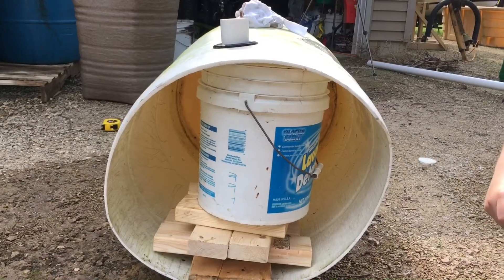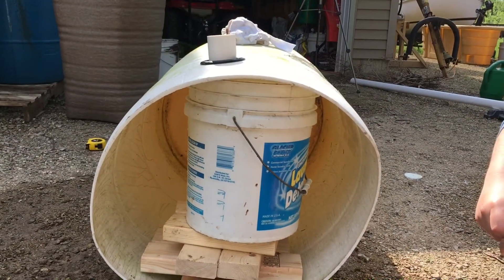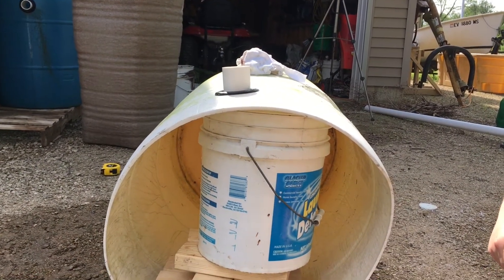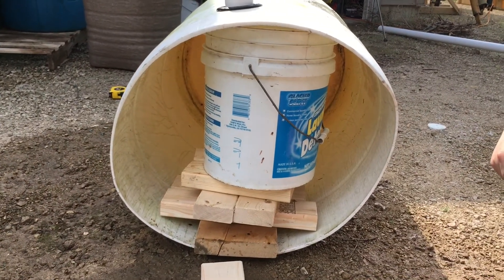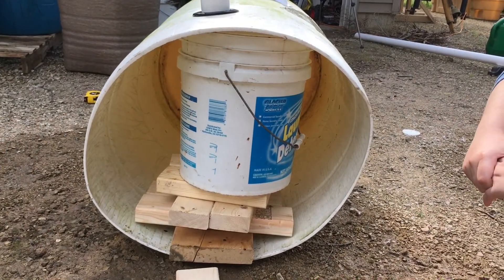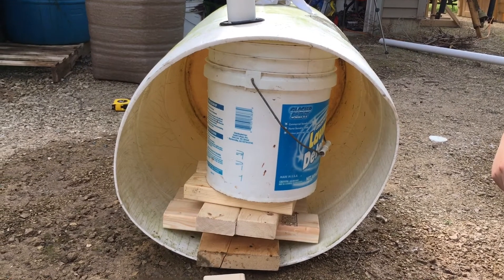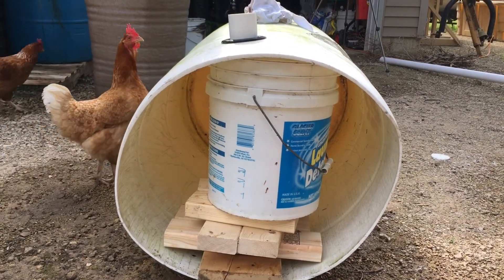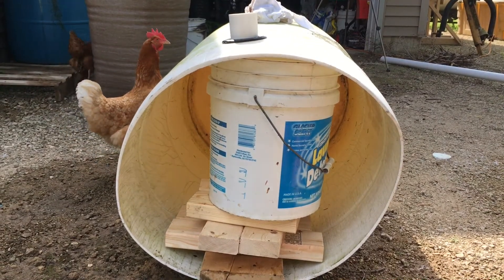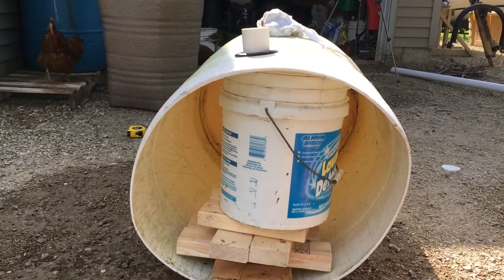Occasionally you get a uniseal that just kicks your butt — this was one of them. We had to put some cribbing in with a bucket underneath to bear down on the pipe and push hard. I had to put all my body weight on it, which was kind of hard on the hands. Use lots of olive oil or whatever lubrication won't harm your garden — soap works too. Brace it, push, bevel the pipe really well, and twist and roll it until it pops through. With a little persistence you'll get it.